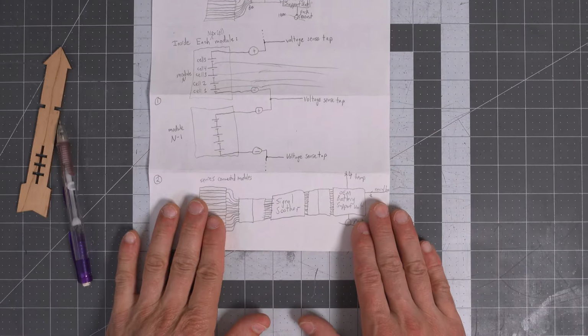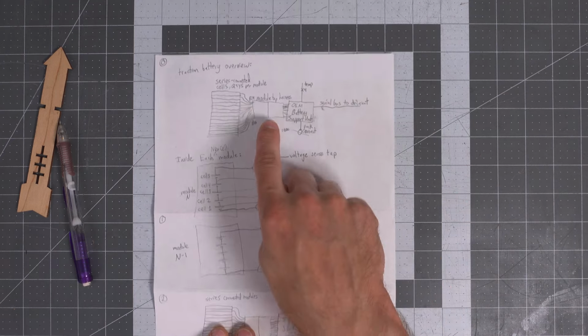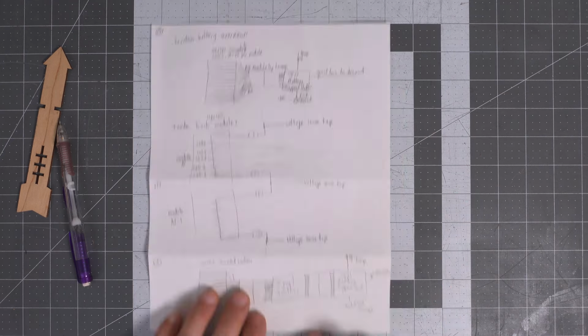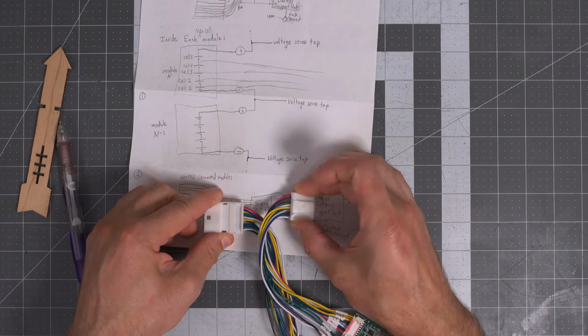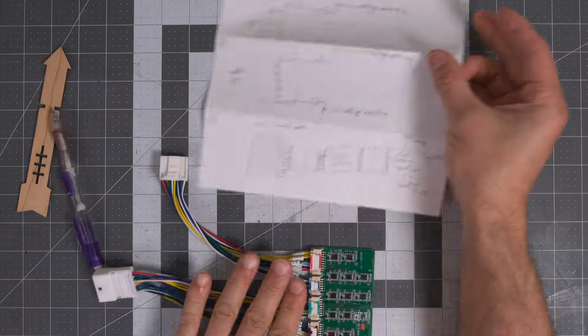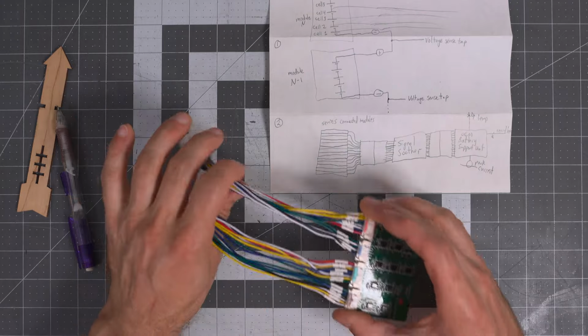So, traction battery overview, inside of each module. What does the signal soother do? The signal soother, you unplug this here, and you plug the signal in between. And so that's kind of what this is. This plugs into the battery here, and then this goes and plugs into the battery support unit. So now we have this signal soother. It's still only looking at the 14 taps because this is just a man in the middle.